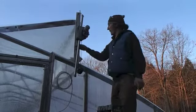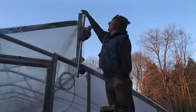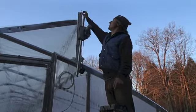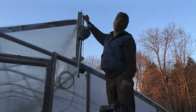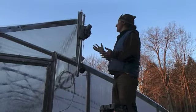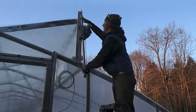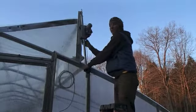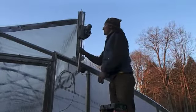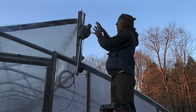You'll see a pipe. This is 17 gauge 1 3/8 inch pipe. You'll see an open end eye bolt with 2 washers, 2 nuts, a chain, and then another small 3/8 inch hex bolt. This is the completed assembly, and what you're looking at is a hanging pipe that runs through the motor itself. The motor will travel up and down that pipe. This pipe is free to hang, free to move, but what that does is keeps the whole motor body from rotating.